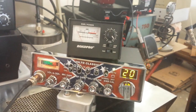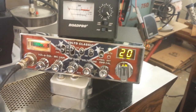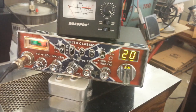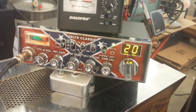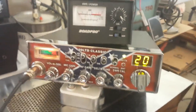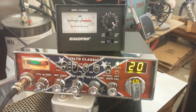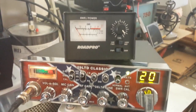So we showed four ways to read SWR. If you're checking SWR in a mobile vehicle, make sure to be as far as possible away from any other vehicles or any metal objects, even as far away from trees if you're able to. But mainly, get away from any metal objects, water, anything. Try to get in a wide open area as much as you can to have an accurate SWR or reflected reading. Any of those things can alter the reading. I have a little place I can drive to that's pretty much right in the middle of a field — that's wherever I go if I'm ever needing to tune something.